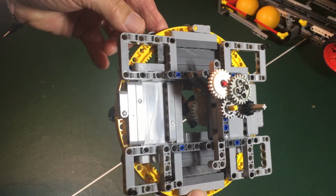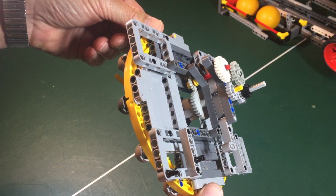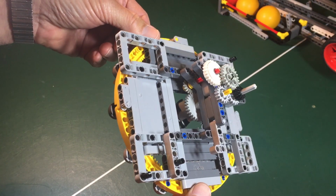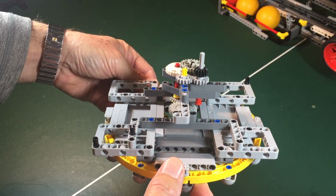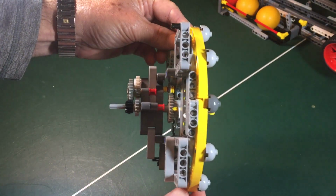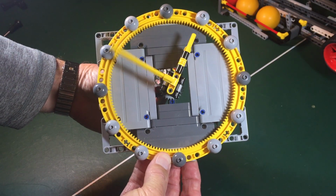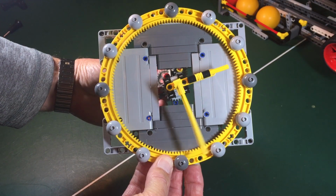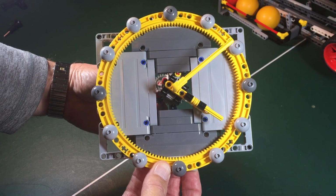This housing can be married with a sister cog to create a 2-to-1 gear reduction. Normally, the sister gear meshes at 90 degrees, but in my design it lies in the same plane. To complete the 12-to-1 reduction, therefore, needs another 3-to-1 gearing and then a final 2-to-1. The trick was to organise these gears so that the final rotation is back onto the same axis as the minute hand which it must connect to.